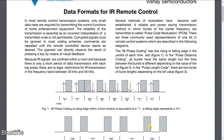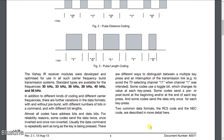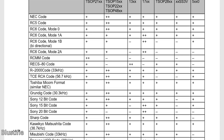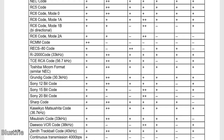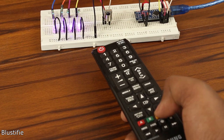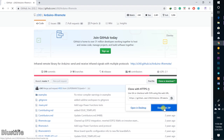Here I still missed something — the data formats. It defines which sequence of burst and pause represents 0 and 1. The most popular data formats are RC5, RC6, NEC, etc. But for this project, we don't have to worry about these data formats. A pre-made library for the Arduino microcontroller can help us a lot.